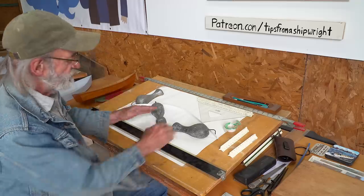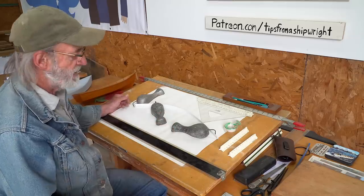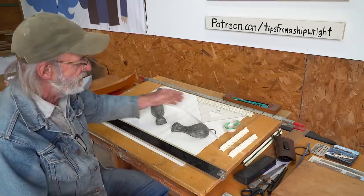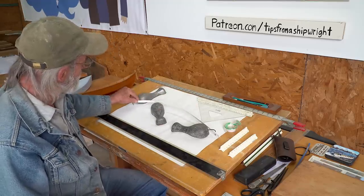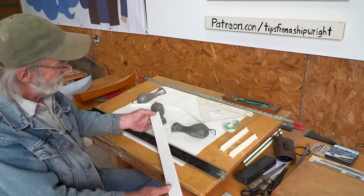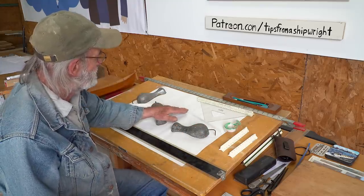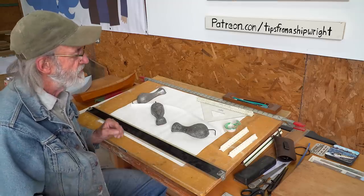The other thing I've got here is some spline weights. You don't need spline weights like this — you can use anything: a cup full of sand, the Tips from a Shipwright cups with nuts and bolts in them, anything you want, because you just push it up against the spline. Now this is a little piece of plastic actually from a Venetian blind right out of my house — I ripped it in thirds on a table saw and it is the right stiffness. It doesn't want to move the spline weights around and yet it's nice and tame; you can hold it down wherever you don't have weights and continue your pencil line.